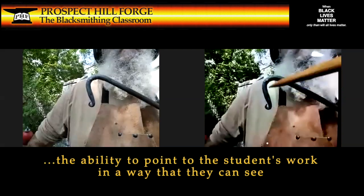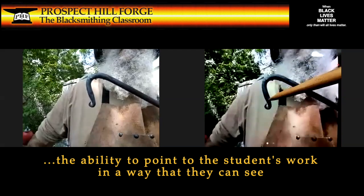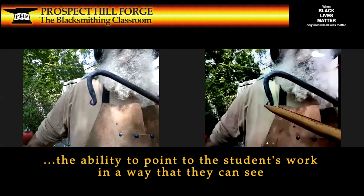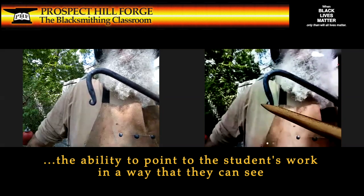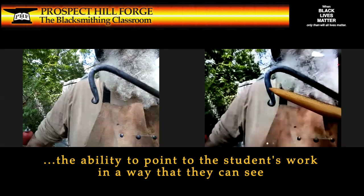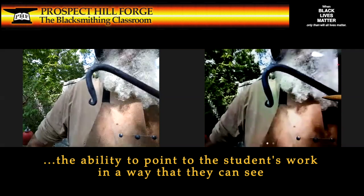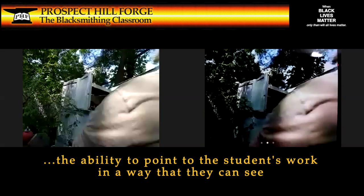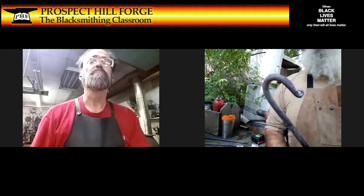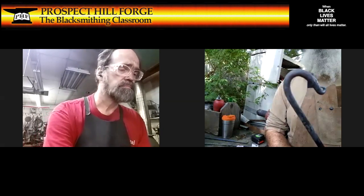Okay. So you're going to heat this area up, quench just the curl. And then you'll catch like the very tip of the curl here against one side of the bending U. And that should put the other side of the bending U somewhere in here. And that should give you some bend right in this area here. Making sense? Yep. We'll find out. Heat it up. All right. Oh, that's already looking better. That looks more intentional. Okay. That's a lot of what we want.